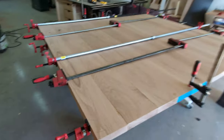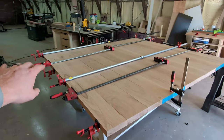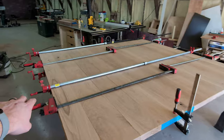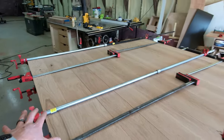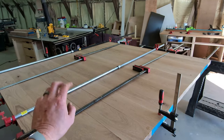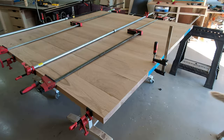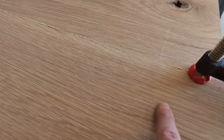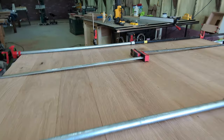There's just no way I could have easily done this without doing small increments first. I bought these little couplers to go onto these 48-inch bars so I can use the four-foot bars regularly and only be out a coupler. Combining my parallel clamps, I was able to get the full span. The most important thing is adequate squeeze-out all the way across the seam, which means I got good clamping pressure.